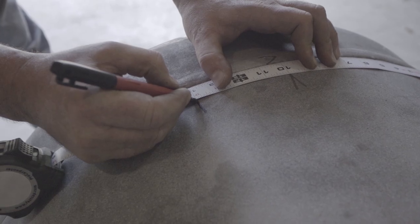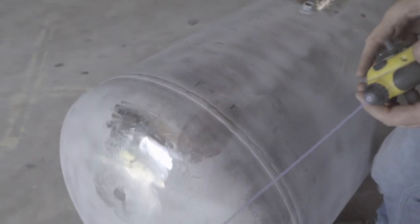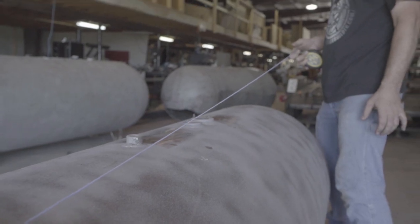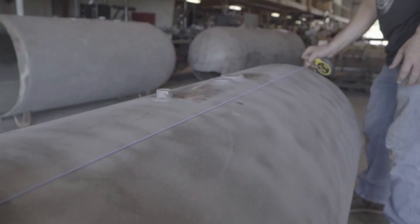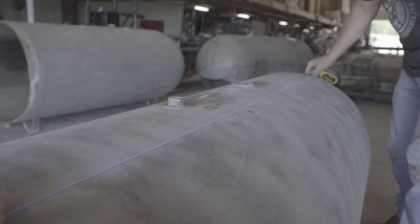We got our mark down at the top door cut. Now we've got to pop a line on there - this is going to be our for-real layout line. Everything else we do is going to be based on this line that we snap. Can you hold a camera and do this at the same time? We'll see. I bet you snapped a line before - many a lines have I snapped. So pull tight and then one guy snaps - you guys probably all did that before.